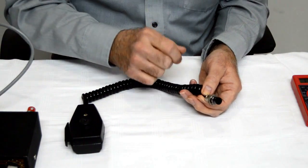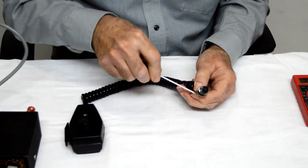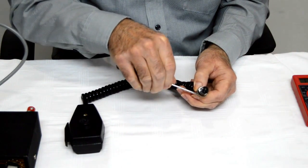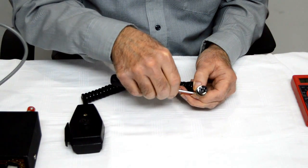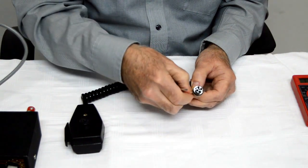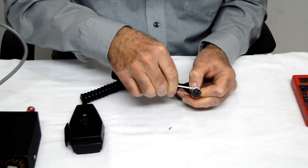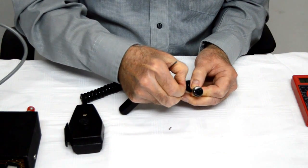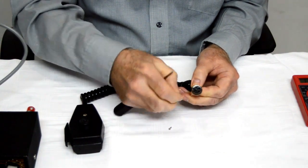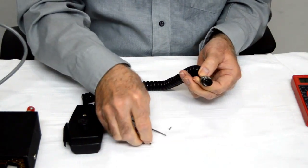We're ready to get this microphone apart. We'll start by taking off those 2 little screws. And you want to use the correct size screwdriver or you'll strip them out. Go ahead and take that one out of there. And we'll take this one out of here. Just like that. Then you can take that little collar off as soon as you get that screw out. That one's stuck in there. Well, the collar fell right out by itself.